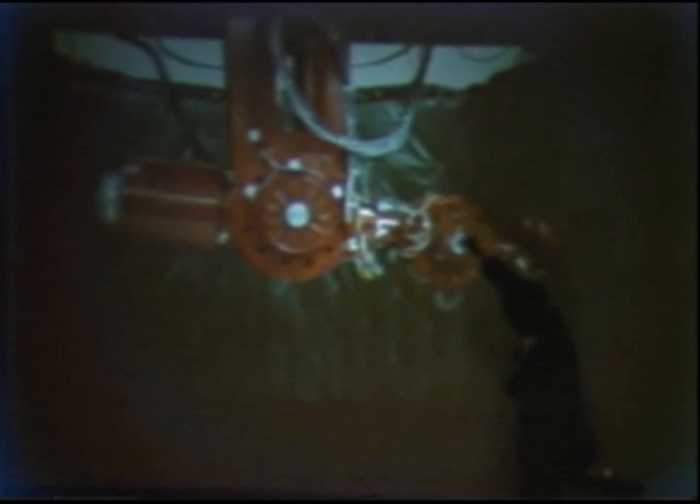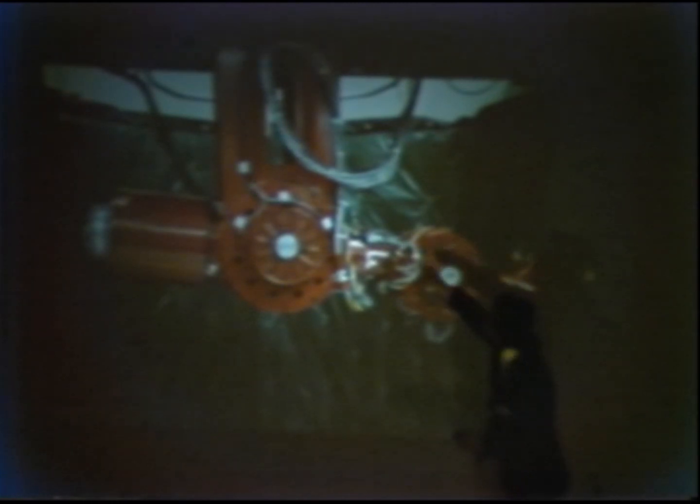This is the shoulder, this is the elbow, and this is the wrist. We need not only high torque, but also a lightweight motor to drive the elbow and wrist parts, because if the motors are heavy, they give a very big load to the shoulder joint. So we need a lightweight motor as well as high torque.